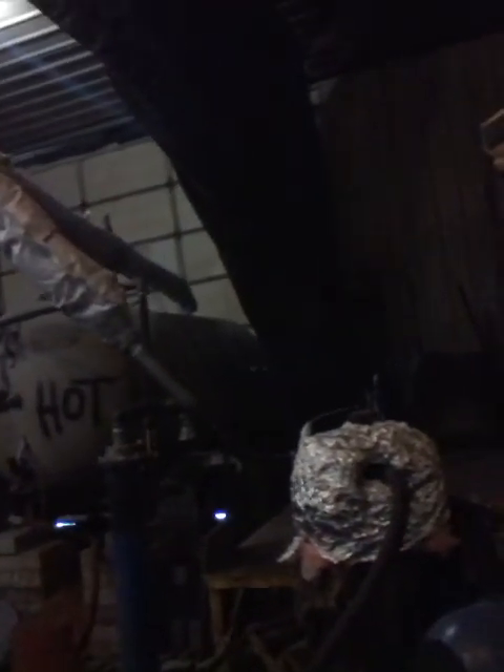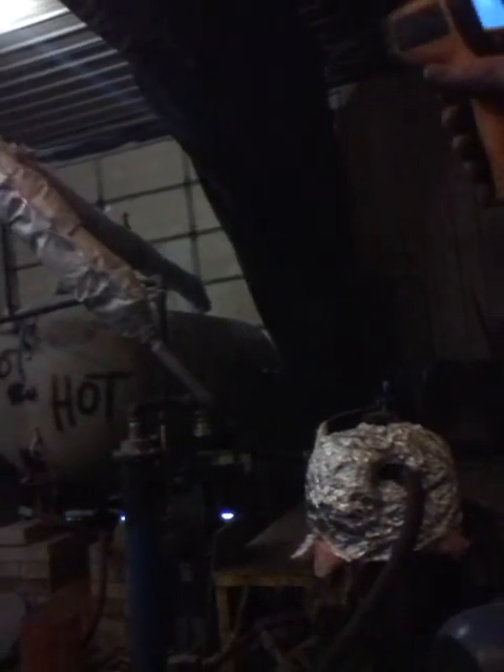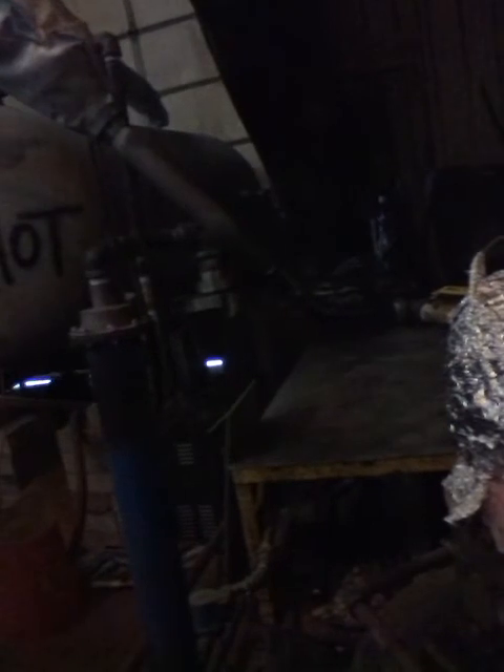The suction line of the compressor is pulling that humid air down and into the compressor. The compressor is then increasing the temperature of this warm humid air to approximately three hundred and twenty-three degrees, and it is coming down into our Tesla turbine which is running at about 50 to 60 PSI. The temperature leaving the turbine is one hundred and seventy-seven degrees, so we have about a hundred and fifty degrees worth of difference.